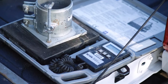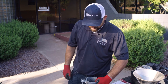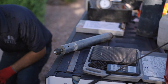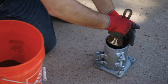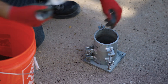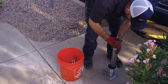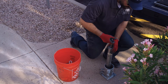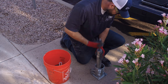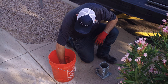We'll get our weight and record that. It's really important for the technicians who perform this test to give it equal lifts so that each lift gets the proper compaction throughout the entire plug in the mold. This will be in three equal lifts. The soil needs to be approximately near optimum moisture — the material from the hole was pretty close to optimum, so we'll go with where it's at. We take our five-and-a-half pound hammer and give it 25 blows, then add material for the second lift.